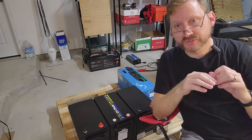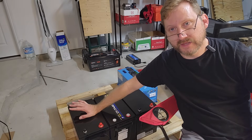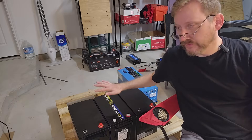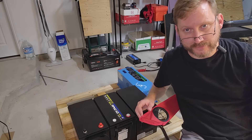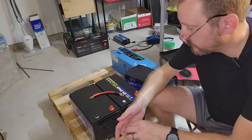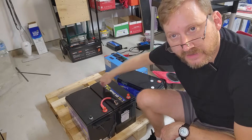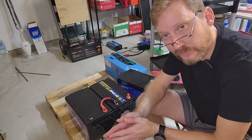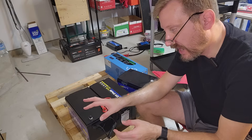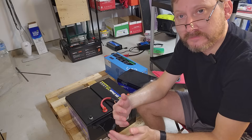So I think 24 volts is the right blend. We're going to do 24 volts. I'm using my Watt Cycle batteries — I'm going to use the big boy. What is the advantage to using one great big 24 volt battery, like I'm about to do, versus two 12 volts chained together? Pros and cons. As I've shown in other videos, turning two 12 volts into a 24 volt battery is really easy — you just take a little jumper wire and jump the positive and negative of the two batteries together. Depending on what's on sale, it might be cheaper to have two 12 volt batteries to make a 24 versus one big 24 volt battery, and I'm okay with that.